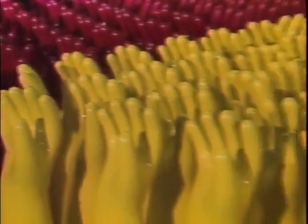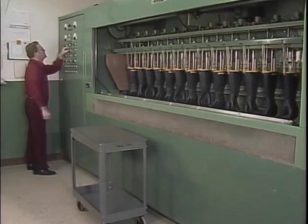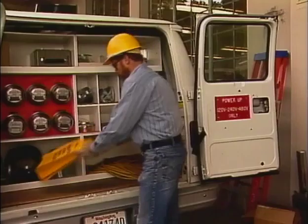Rubber gloves are made by dipping forms in liquid organic rubber until the correct thickness for the rated voltage is obtained. Like other organic substances, the rubber can be damaged or decompose under some conditions. So all rubber gear must be tested and certified for use periodically. After it has been certified, it is stamped with a date that indicates the day that it should be turned in to be tested again. Make sure that any rubber gear you use has a valid date.